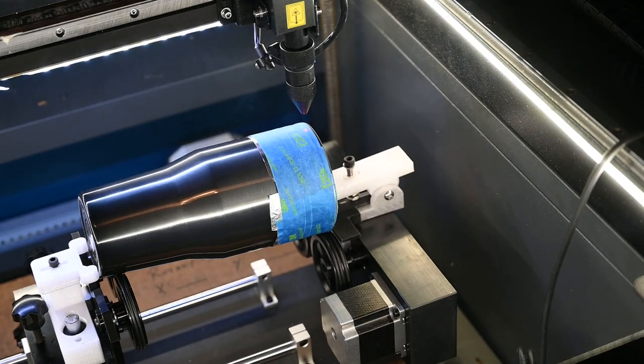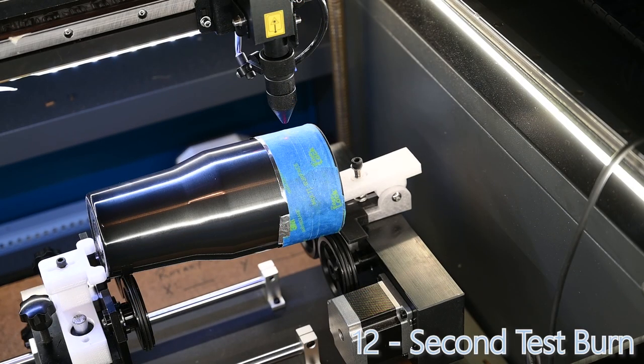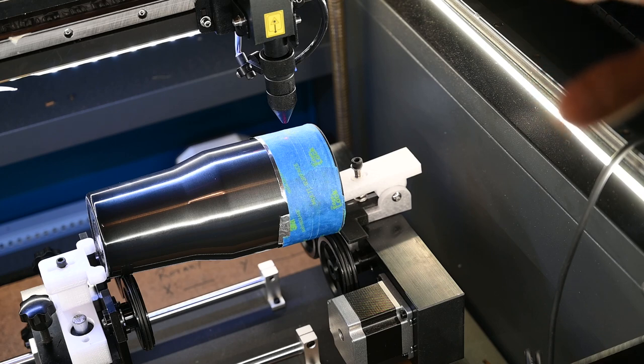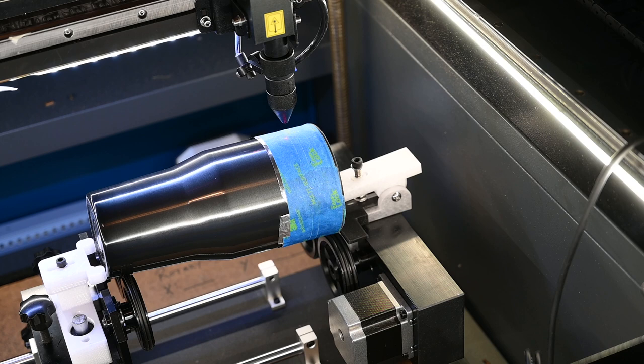This is why we do a test — I can see I'm going to need to do a little tweaking because my arrow points did not line up. We've tweaked our settings and now have our steps per rotation at 3065. I didn't change the diameter of the cup at all — just 3065 for steps per rotation. We're going to do another test burn and see how that goes.